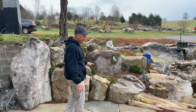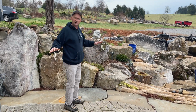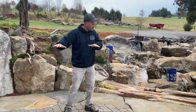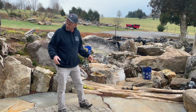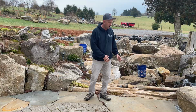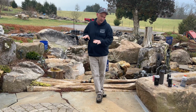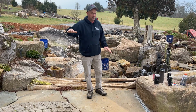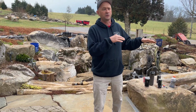And getting in the back in here, doing the drainage system underneath. There's a drain back here. We're very careful as we're doing the construction so that the water that runs off the patio doesn't run right into the reservoir. So they designed this, started with the drain back there against the house. The drain lines run along. We install this channel drain right here, so it's actually all pitched towards me and a little bit this way. So this side of the patio runs into this drain, which joins together with the overflow that we installed and goes away.